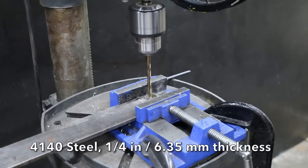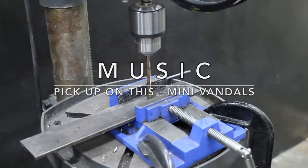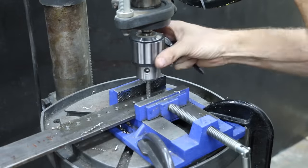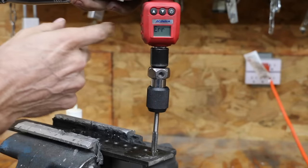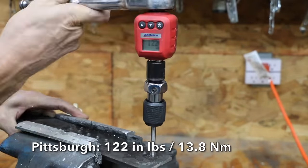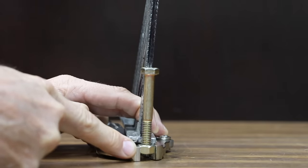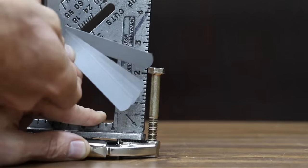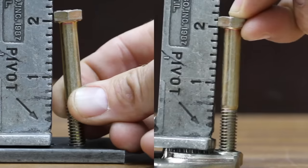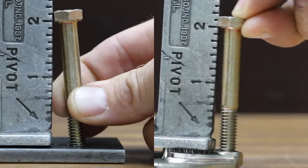Let's compare the taps as they cut through some quarter-inch 4140 steel, which is a lot harder than aluminum but only half the thickness. Just like the first test, I'll start the taps in the drill press to make sure the tap is perfectly aligned. I'll use a larger torque adapter in case more torque is needed. The Pittsburgh needed 122 inch-pounds—only 4 inch-pounds more on average than the half-inch aluminum. Measuring side-to-side play with a feeler gauge: the nut serves as our control at 1.18 millimeters. The Pittsburgh has 2.93 millimeters of side-to-side movement—nearly three times as much as the nut.